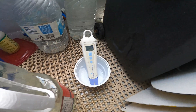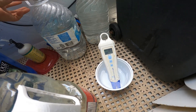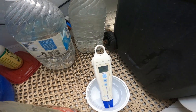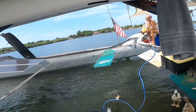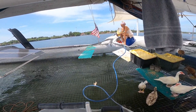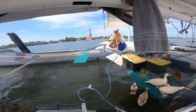It's 0.4 on the EC scale, which stands for electrical conductivity. To find the PPMs you multiply that number by 500, which gives you the sodium chloride scale — there's also a 700 PPM scale but that's used more in hydroponics for potassium chloride. The water maker's recovery rate is 15 gallons an hour with an amp draw of 4 amps from our 48-volt bank. Woohoo!